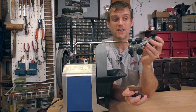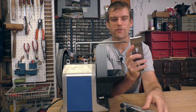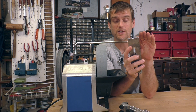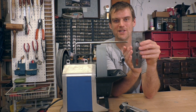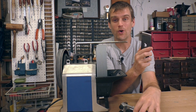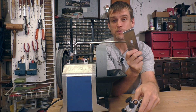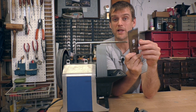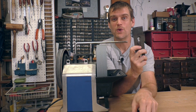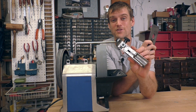What's awesome about this jig is that there are a couple of micro adjust knobs, so not only can you get a perfectly straight plane blade across the front, but you can also dial it in to be exactly 90 degrees to the edge. Also using the micro adjust knobs, you can actually camber a plane blade, making it slightly convex, which is desirable in some plane blades. Today I'm going to show you how to camber a plane blade using the Tormek and the SE-77 straight edge jig.